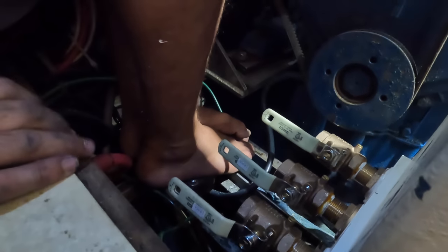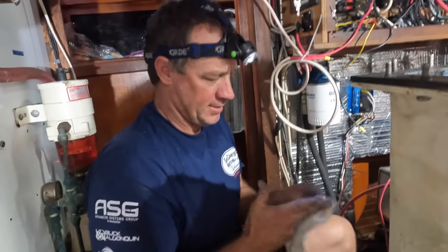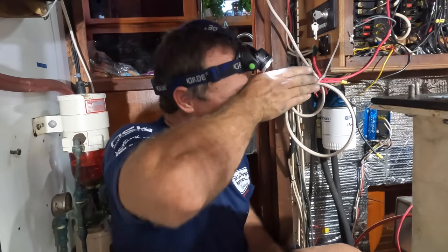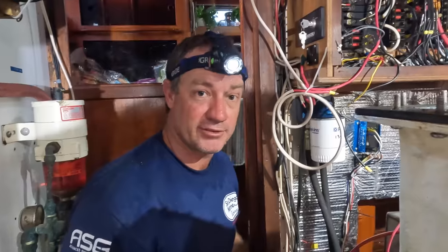That'll do for now. Turn them on. They're all that way. Turn them off. They're all up. Usually how we do it is a valve handle runs with the pipe. If a valve handle points in the direction of flow generally, if you can make it work that way. Sometimes you can't, but generally that's what we try and do.